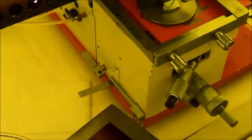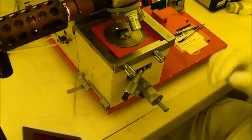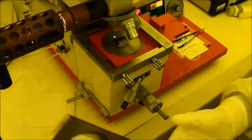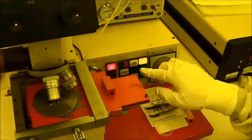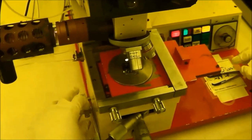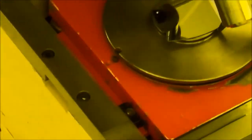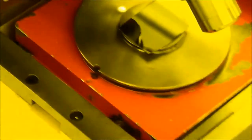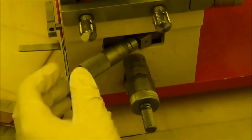So during your alignment, there is no difference, because at this stage, whatever mode you choose, soft, standard, or high vacuum, when you lift it up, the chuck will make a vacuum to hold your sample. So in that case, you can move back and forth, left and right, and change the angle of the stage. To make an alignment, this is for Y direction, this is for X, this is for angle.